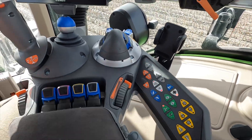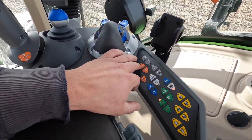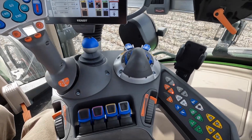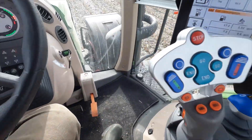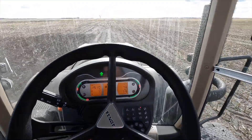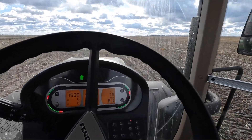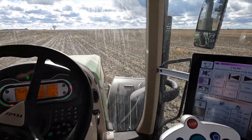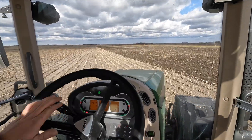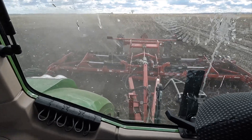You can also change whether your front axle suspension is on, differential lock, and a few other things. There's GPS and buttons to control the radio volume. You've also got what Fendt calls TMS and foot pedal mode. Basically, TMS runs the RPMs according to the power the tractor thinks it needs. In foot pedal mode you run the tractor with your foot like an automatic transmission - you don't throttle the tractor up manually; it throttles itself. I'm a big fan of that - I use it all the time when we have a hay trailer behind the tractor or even with the manure spreader going up and down the road.